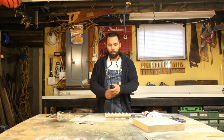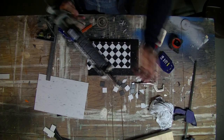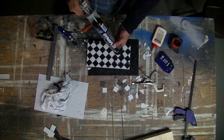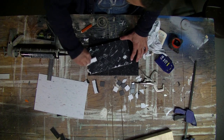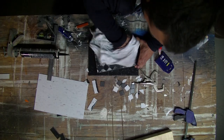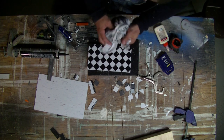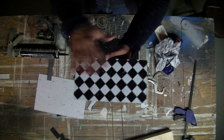Here's the additional step that you may or may not take. I take my big black caulk and cut just a tiny bit of it off. You can use white caulking, black caulking, what have you. Have a wet rag at the ready. It's essentially just like you're grouting tile — and if you never grouted tile, it's kind of like you're just spreading caulk on a miniature floor. Then you have your wet rag to wipe it clean. I think this last step fills it out quite a bit nicer — fills all those little gaps and cracks and makes it look pretty tight.